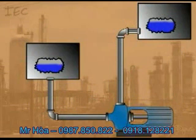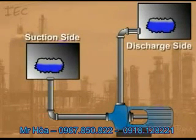Pressure head is a convenient term used in pumping to describe the pressure required to force liquid into a pump. In order to calculate the system, you will need to know the static head on both the suction and the discharge side of the pump. In addition to static head, there are two more heads you will need to know to complete the calculation.